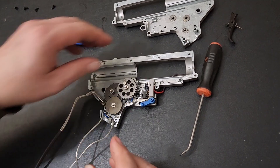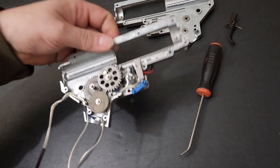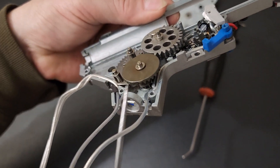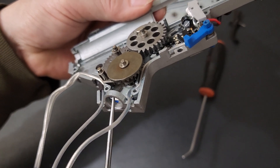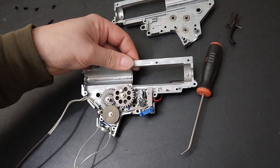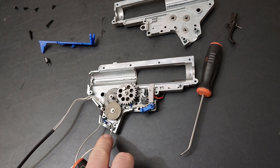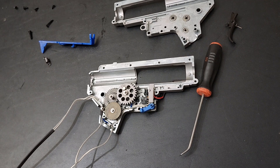One other thing I noticed — there's a little collar where the motor goes through the gearbox, which seems to be there to keep the motor more steady and give it stability. I've never seen the bottom of gearboxes break, but I have seen the threaded holes strip out from people over-tightening the motor grip. Overall, I'm not upset at all with what I see here — for a factory out-of-the-box setup, it's decent.